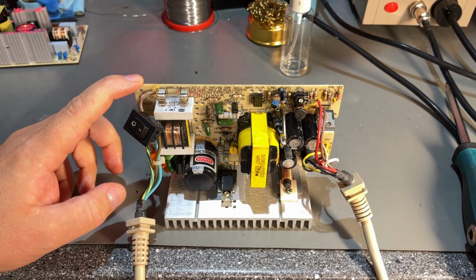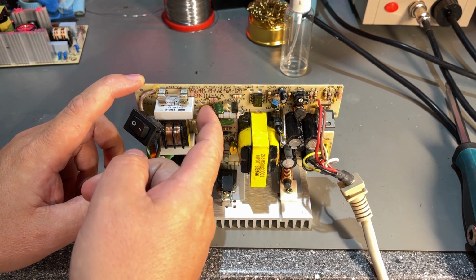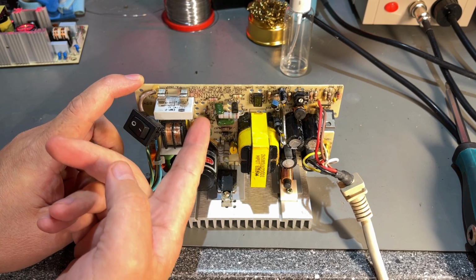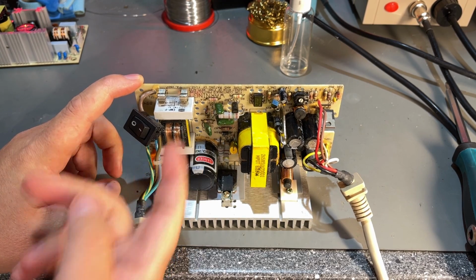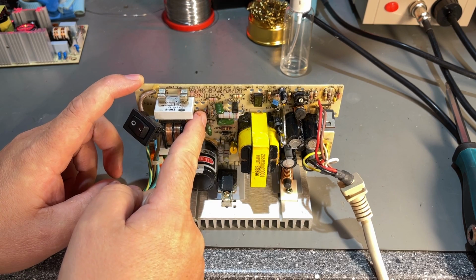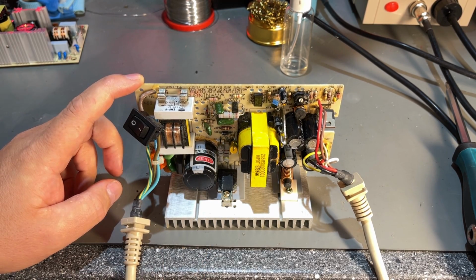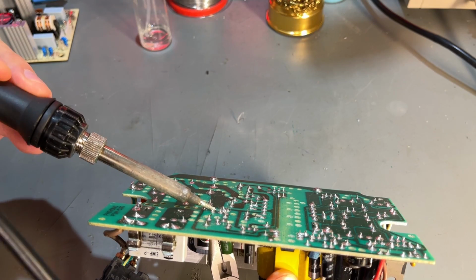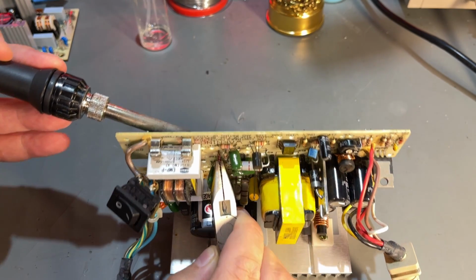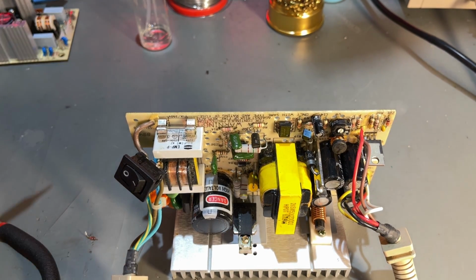While I'm waiting for that print to finish, I was thinking maybe I should take a further look at this old power supply, see if I can fix it by replacing that little Zener diode that's broken off. I'm not really sure if I have a replacement. I'm going to take it out and measure it and see if I can figure out what it is. It's out.